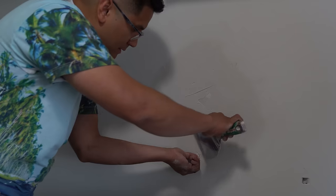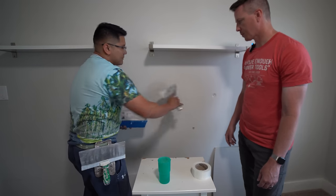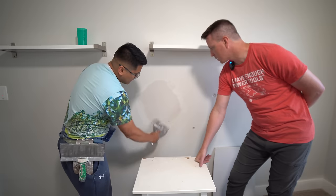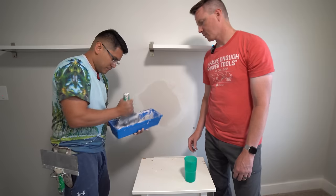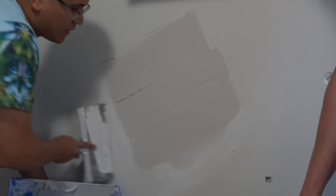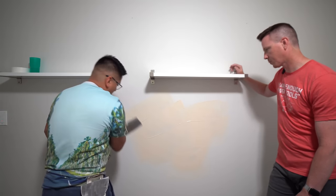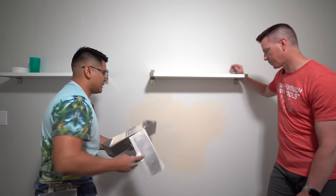The first layer should just get everything level with the surface of the wall. After that, apply your mesh tape or paper, then a second layer — keeping it thin. Do not cake it on too thick; smooth it out and remove the excess. There may be some tape visible through the first layer and that's okay. The second coat should be slightly nicer but still thin. Finally, apply the blue-lid topping compound as smooth as possible, feathering the edges and progressively making each layer wider to blend into the surrounding wall.